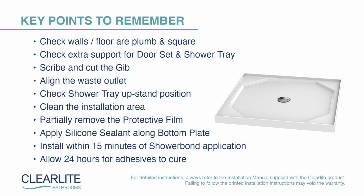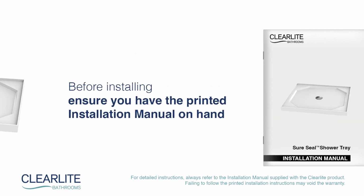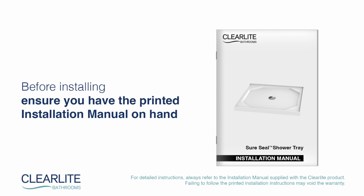Install within 15 minutes of shower bond application. Allow 24 hours for adhesives to cure. For detailed instructions, always refer to the installation manual supplied with the Clearlite product. Failing to follow the printed installation instructions may void the warranty.